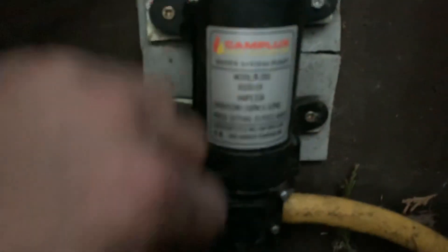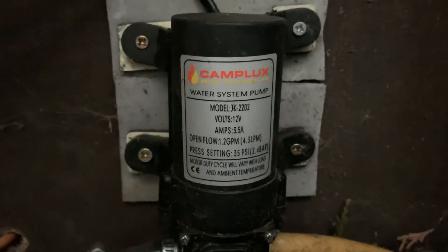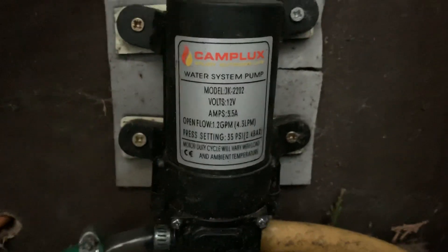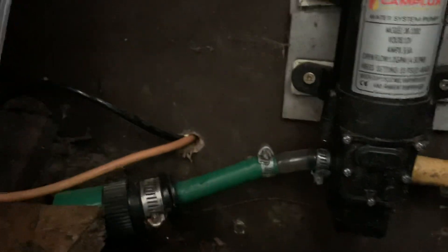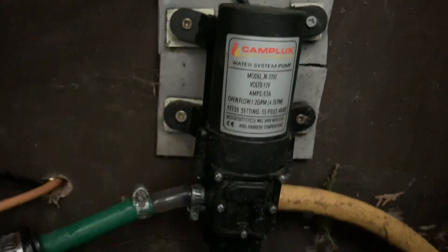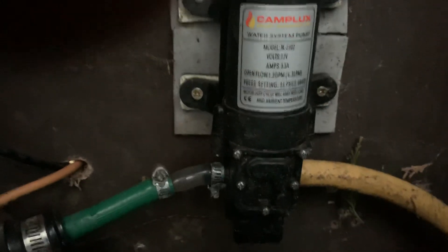This — I don't know if you've seen it — to be honest, I'm thinking we're going to have to upgrade this anyway, because it's 35 PSI, 2.4 bar. And what I'm starting to find is, obviously, as I'm adding more valves to my irrigation system, I'm losing pressure, and I just don't think this is cutting it now. It was all right at first when I first got it and only had a few things in. But as I'm starting to add more, I think I'm definitely going to have to upgrade this — maybe next year.